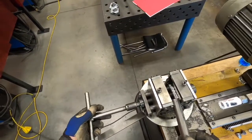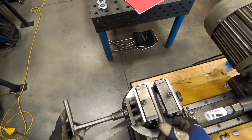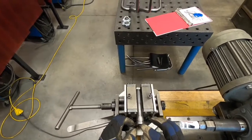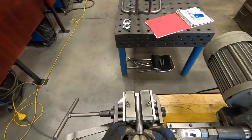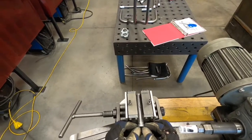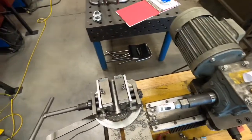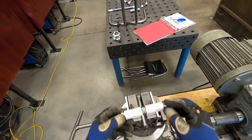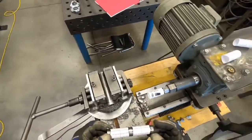We've got our chuck key here to tighten the vise. On straight tube pieces, I always put the weld seam on top, so when I flip it over to cut the other side, all I've got to do is line up that weld seam again and I know it's clocked correctly. If you cut one side and flip it over without getting it clocked right, instead of having your cross member hit your frame nice and square, you could have it crooked and it won't line up on that flat piece.